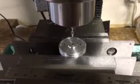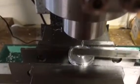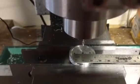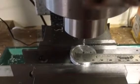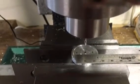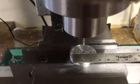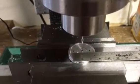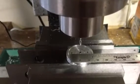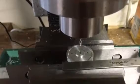Just picked five holes — I think that'll look good. This pulley measures about an inch and a quarter overall diameter. And it's going to use the DRO. I'm using the Grizzly G0759 mill with the DRO. I've marked out with Sharpie where I think it'll look good for the positioning. That's three quarters of an inch diameter, so three eighths from the center hole. So let's go over to the DRO and take a look at that.